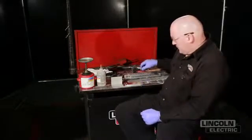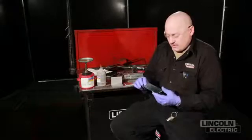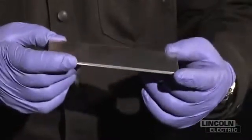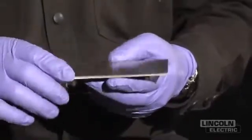I have several forms of aluminum here. I have some cold-worked 3003 aluminum which is pretty bright and shiny. We purchased this for our school. It's a non-heat-treatable aluminum and it's actually pretty easy to weld on this without any additional cleaning. In a school we don't even bother brushing it.